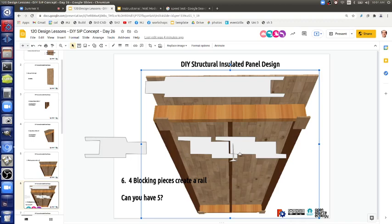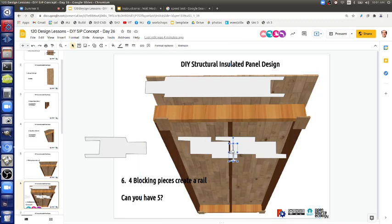However, in this one, there's a thing that you have to constrain two dimensions at the same time. Do you see that? Yep. So you need to constrain this dimension as you are constraining this dimension, because you can get it perfectly aligned, but it might not be pinched in all the way. Or you can pinch it in all the way first, and it may be a little misaligned. Those two constraints are fighting each other. You have to do one at a time.